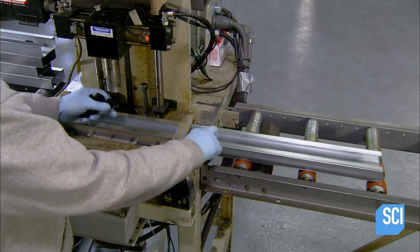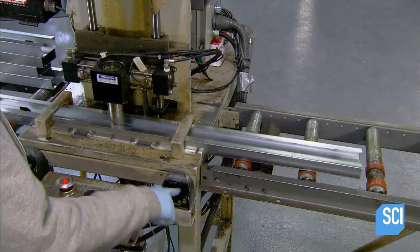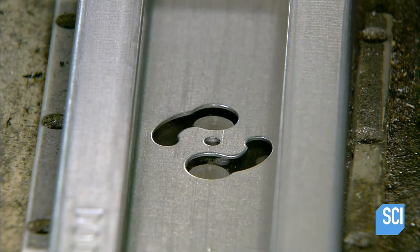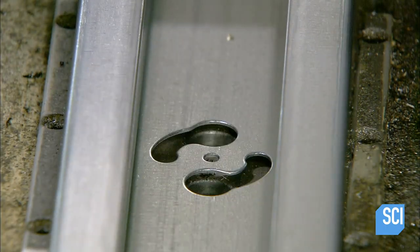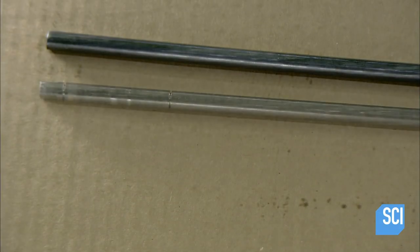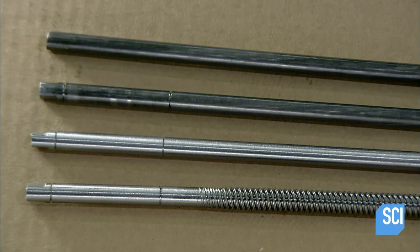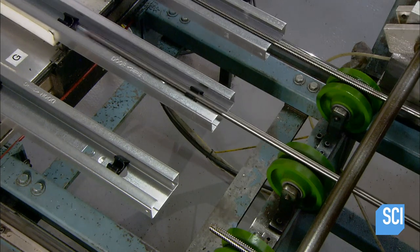The carriage rail is milled from galvanized steel. It has slots for locking in plastic liners, which hold the screw rod. To produce the screw rod, the factory machines a solid bar of steel to the required dimensions and profile. Then, with high pressure rollers, it forms threads in it.